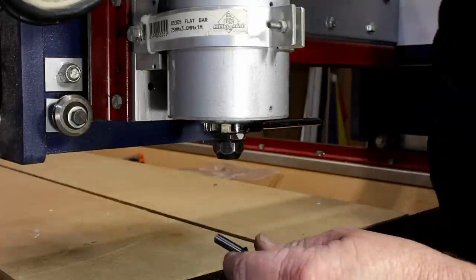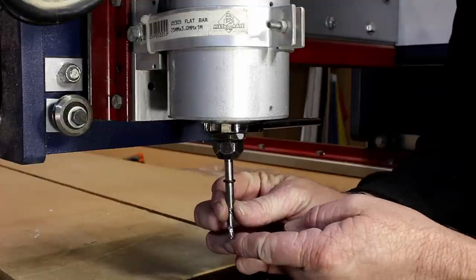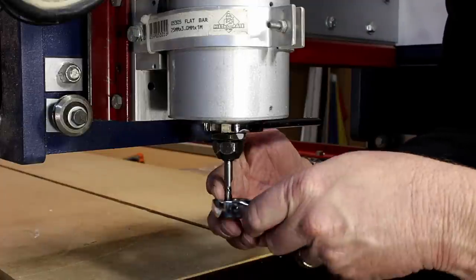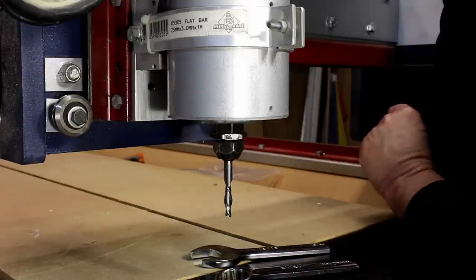Now another possible way of using the O-ring: if you've got the O-ring on your cutter, you can simply use it as a stop. If you push it in from underneath — you've got to use your three hands to do it — you can use it to set the height of the cutter.